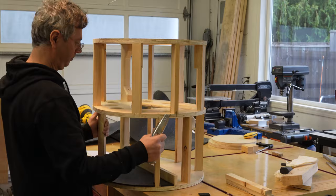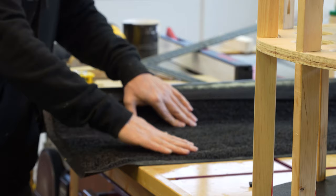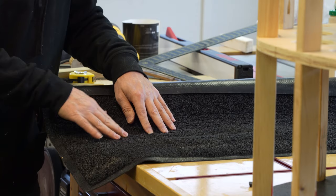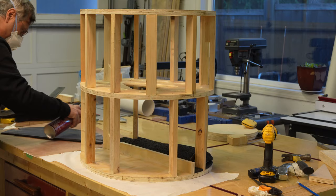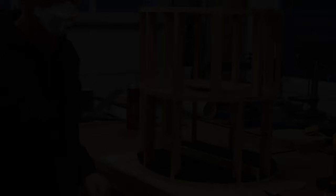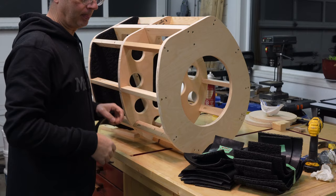The back is a very important part. I added a quarter-inch piece of heavy-duty rubber on it, and on top of that another piece of soft rubber — like a shredded rubber mat from a hardware store. I like using inexpensive things whenever I can and saving money for better components otherwise. Both rubber pieces were glued with spray adhesive. The back portion is always very important — it's the piece that's going to take the brunt of the forces, so it's important to be as dampened as possible. An additional layer of plywood was added on the outside at the very end as well.